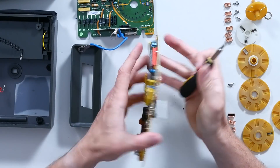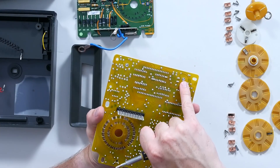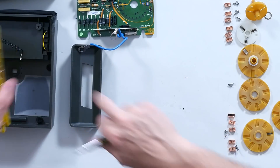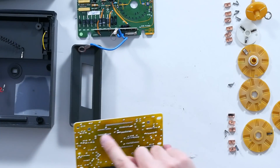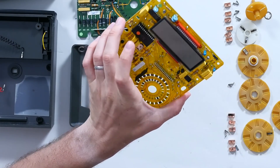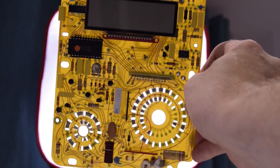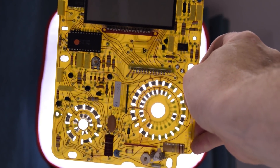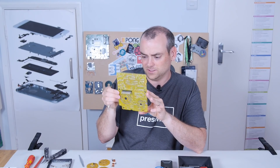Another feature I've just noticed — these two metallically filled holes actually correspond to the screw holes in the back of the plastic, so two of those screws go straight into these lugs on the PCB. It's only a single-layer PCB front and back layout, and holding it up to the light, again, that organically hand-drawn PCB layout — incredibly low density. You can see why modern multimeters are about a third of the size of this, but that is a work of art.